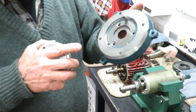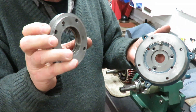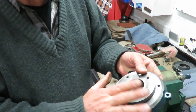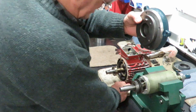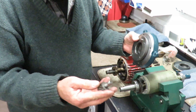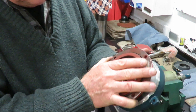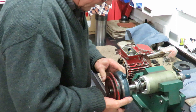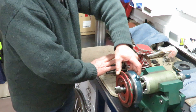I've stacked everything together, machined this down with a counterbore, machined this with a face and a taper, then drilled and fitted a dowel pin so that we can make sure everything goes together correctly when they come to mount it. The gear will be fitted on the shaft only after that. I've bored it, counterbored it, drilled the pin, and it's all ready. That pin locates all the pieces together and the gear will be fitted at the same distance as it was in the previous motor.